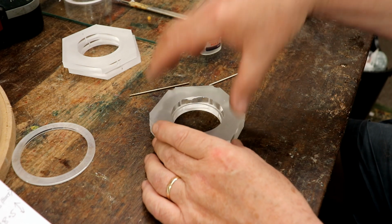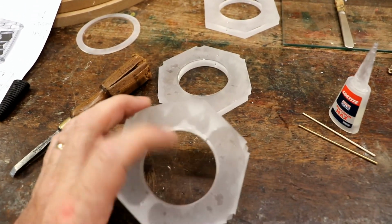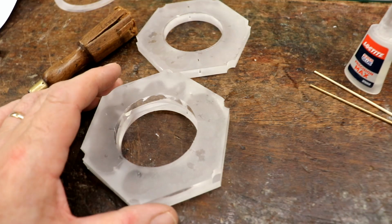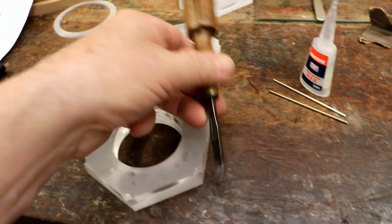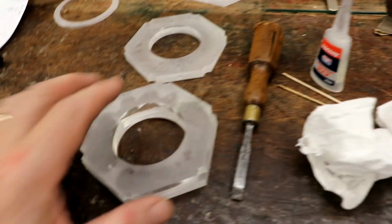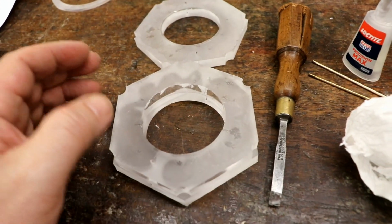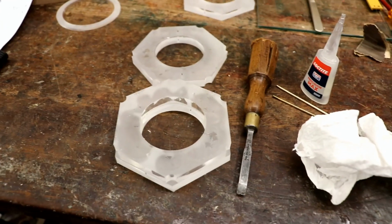And I can just carry on stacking them up. That'll teach me to get too carried away. I just realised that I'd glued the two with little rebates in together. What a pain. Another top tip for you. You can make a minor adjustment with a chisel and a hammer. If the glue hasn't set for that long, just a sharp couple of taps, and with acrylic this thick, it just comes apart. So I'd lightly sand off the remaining glue, and thankfully then I can carry on.